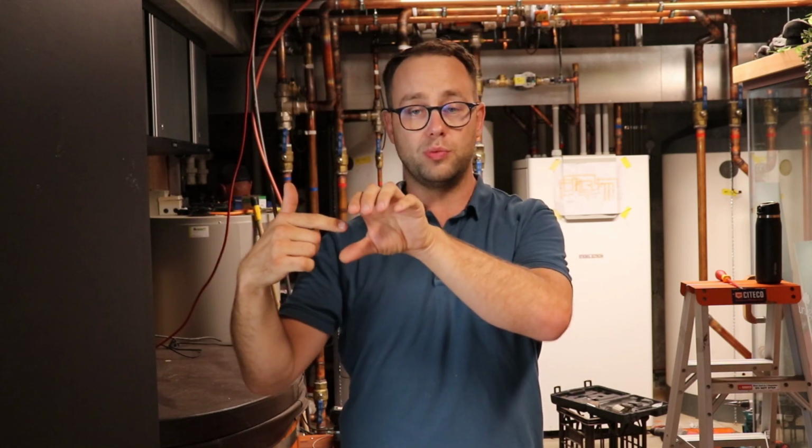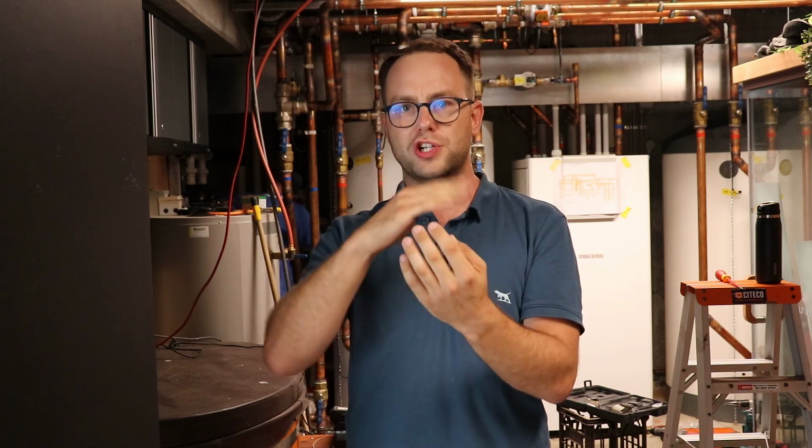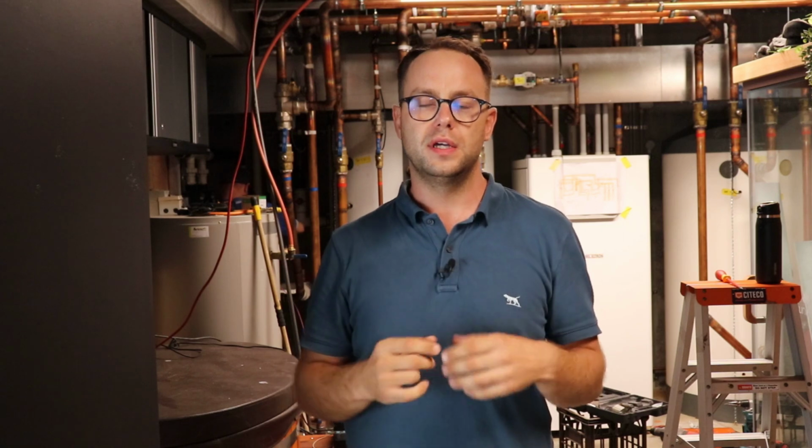So this company had, for example, if this was the constant port, connected one of the other ports as the constant port. And what that means is that the valve can't actually mix properly. It thinks it's mixing, say 70-30%, but it's way off because it's got a special disc inside which determines the flow rate through each port of the valve. So first of all, that wasn't working. And what that means is that the energy was never going to the right places.